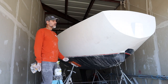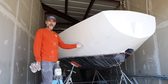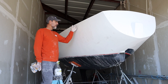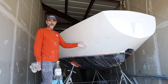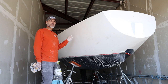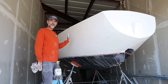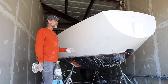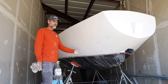That's the reason I went with six coats. Now if you were going to leave it as-is, you'd put one coat on, sand that to 400 grit, put another coat on, sand that with 400 grit, then put your final coat on and just roll it and leave it. You really need to sand between each coat. Once you put your third coat on, it should flow out depending on how you mixed it, the weather, the wind, sunlight — all those things factor into getting a perfectly smooth surface.